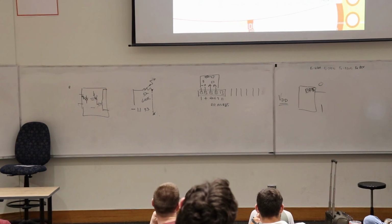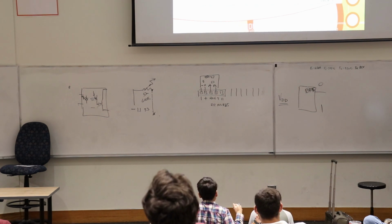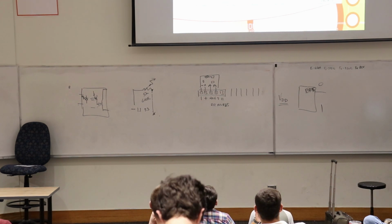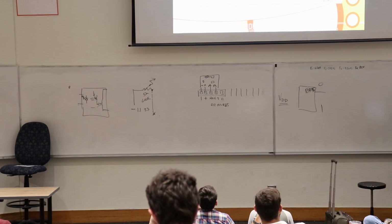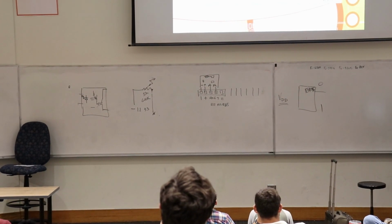So here's the data sheet. And look at this, kind of interesting, right? There's a couple of lines. We have special lines when we hook it up for I2C. We have to have pull-up resistors and stuff like that, so we don't worry about this. And then there's SM bus levels, we're not going to worry about that. And then the master clear and a couple of other things, so forget that stuff. What we're really interested in are the two lines: TTL buffer, which would be the standard output, and Schmitt trigger, which is one of the selections you can make.